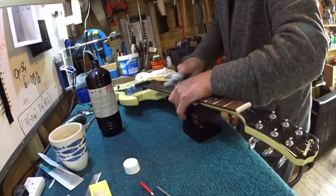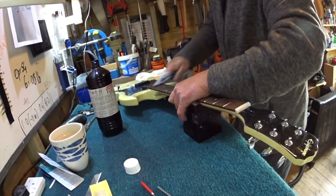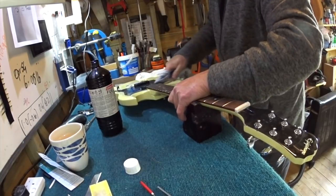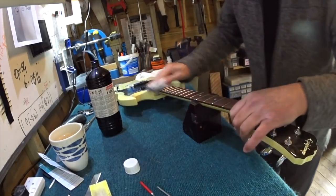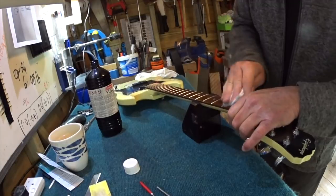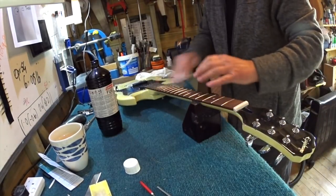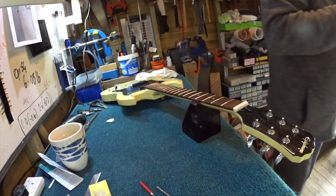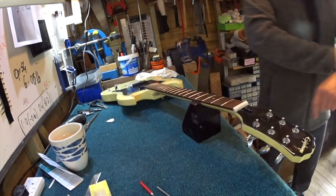I do two pieces each of those using mostly a foam pad. Once I've finished that, I switch to a micro mesh polishing set, which itself runs from about 1500 through to 12,000 grit. Even this doesn't remove the impressions of people's fingers, although the goo is gone. That's a BB King song, isn't it? The goo is gone. So you get a filthy rag that can go in the bin.